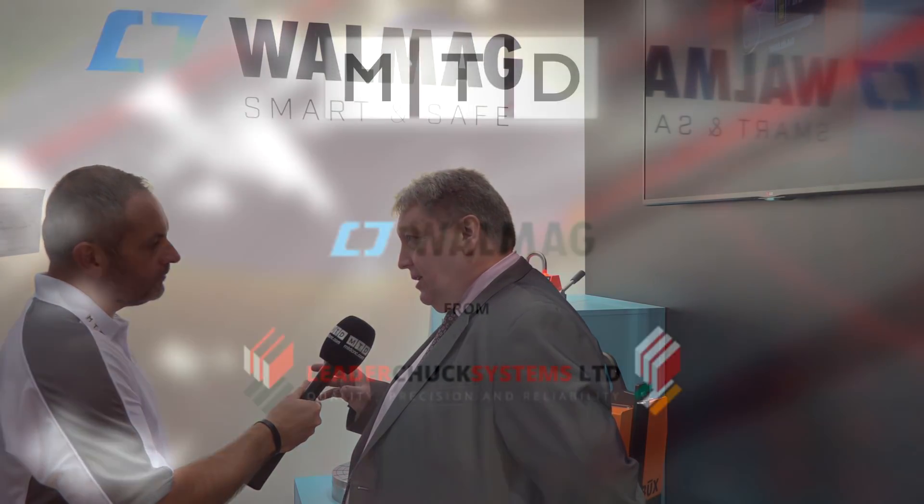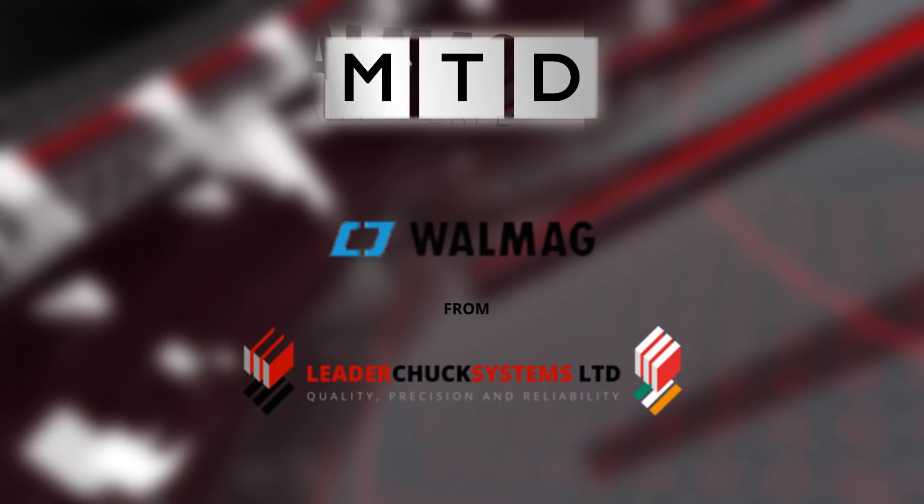It's fast clamping, no deformation. But if I wanted to make sure it was true effectively, how can you utilise this product? What we would recommend in that case is an upgrade, or take the option of the Alustar. This is a lighter variety of chuck, but it has variable force clamping. For example, you might apply 20% of the clamping force, you would true up your workpiece so you know it's concentric, and then you would apply the other 80%. It gives you the option for that fine adjustment before you apply full force.